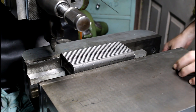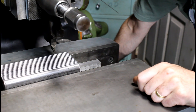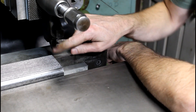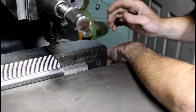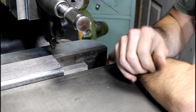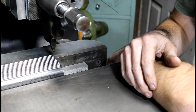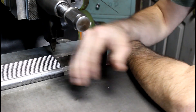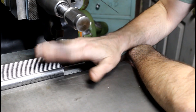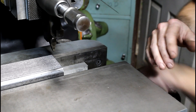We've got the vise turned around — let's get this part set up and we'll cut the cross-hatches in. You know, knurling is something that's pretty commonly done with a shaper. With your stroke feed rate, your movement per stroke, your cutter shape, you've got a lot of options when it comes to patterns. This is a 90 degree pattern — you can do anything in between with a swiveling vise. Knurling is definitely a good thing with a shaper. It adds a lot of flexibility to the shop. Let's cut this thing.